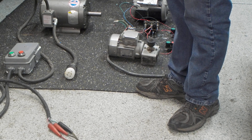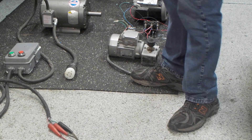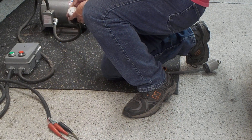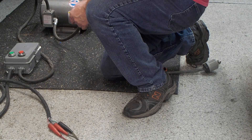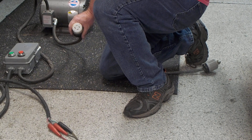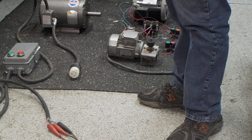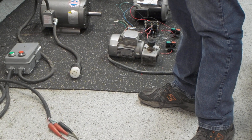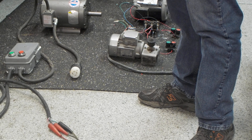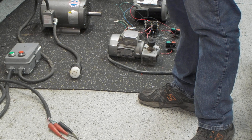As far as this video is concerned, all you've got to really worry about is getting your ground wire correct. This plug here is a NEMA 20 amp plug. You'll see one leg looks a little bit different — it has a little tip that points to the output, which denotes it's a 20 amp NEMA plug. You may want to replace that with whatever you're going to run this thing on. If you're going to run a bus bar or another distribution, or wanted to make a multiple-tap plug or whatever, by all means you can holler at me at any time and we'll get you working one way or the other.